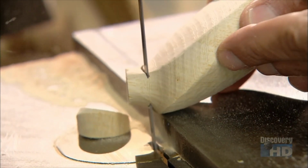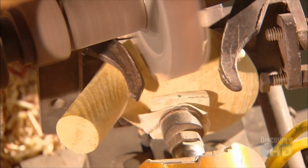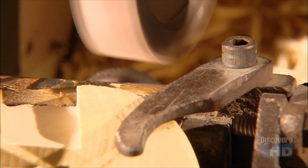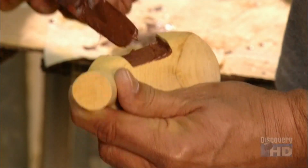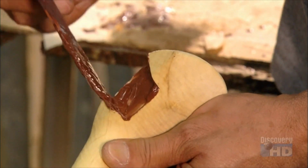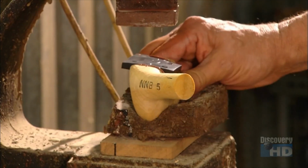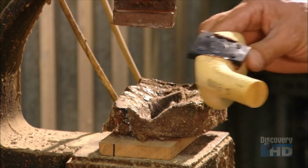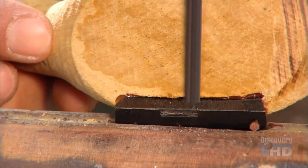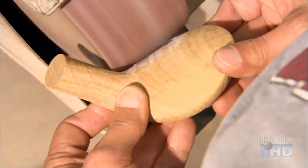They cut the stub off the duplicate, and they smooth it with a light sanding. Next, using a spinning cutter, they carve a generous slot into the face of the club head. They spread a lot of heavy-duty glue in the slot, and then they plug it with an insert made of rigid plastic. The insert will protect the wooden club head from the force of the golf ball. They trim the overlap, and then they sand it until the plastic insert blends seamlessly with the wood.